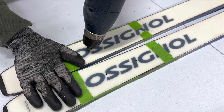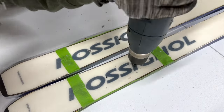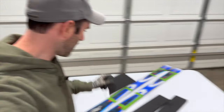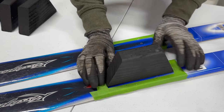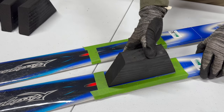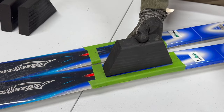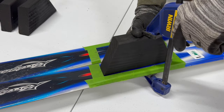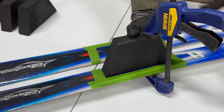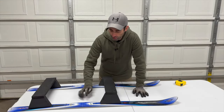The paint has dried and it's ready for the fun part: attaching the supports. The most important thing is getting the supports placed exactly right — that's what makes the sled track straight and be easy to pull. That's why we've got it taped out. Put the support right where it needs to be, clamp it in place, then pre-drill and use the two three-inch screws to tighten the support down. We've got all four supports attached.